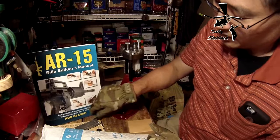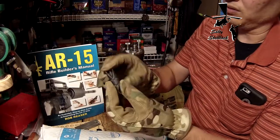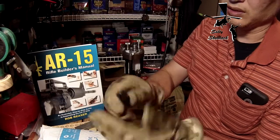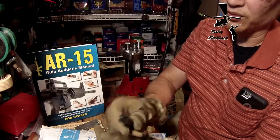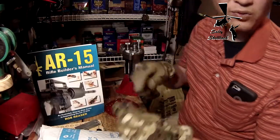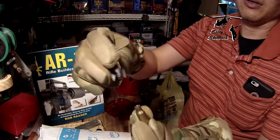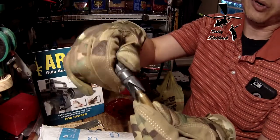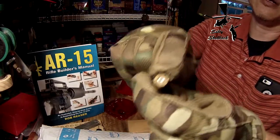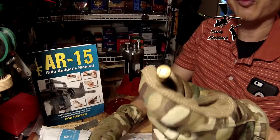The other one — I don't remember who recommended this, maybe it was the Ammo Channel — definitely a worthwhile tool if you need to trim cases such as with 223. These are nice to trim the case mouth or to deburr the case mouth. Also, if you have swaged or staked primer pockets, this will taper off the primer pocket so you can get a primer in there.